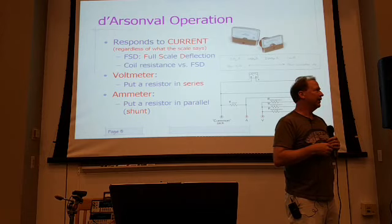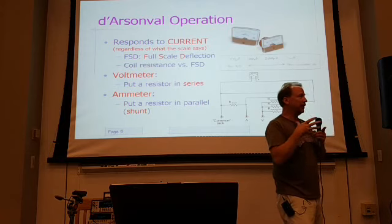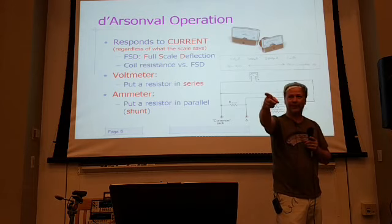And that's when you go for your vacuum tube volt meter. And it's a bit of a trade-off, because if I say, well, I want to load my circuit less, so I'll go to a higher scale so I have a higher resistance, now you're on the lower end of the scale where the accuracy is worse, right? So these are things you have to understand when you're using these things.